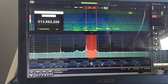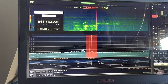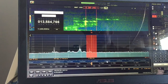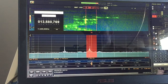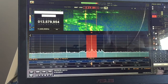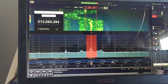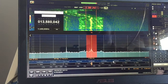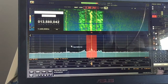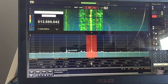Let's see how close we can get back to 13,580. The bar above that is in five kilohertz steps, so it's much finer. You can tune very quickly and get reasonably close — I can use this to get to within 42 hertz of 13,580. The other thing you can do is point your mouse cursor at a signal in the spectrum and just click it. Doing that, we've dropped about 10 kilohertz. Click it back and we're back at 13,580.